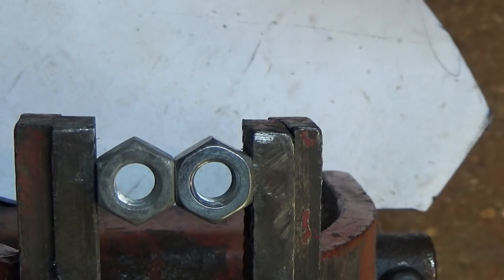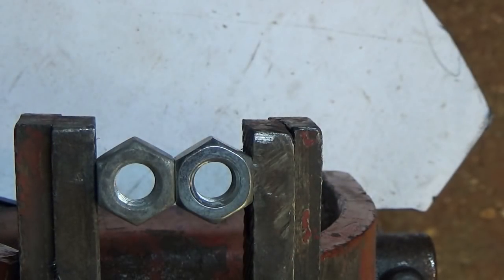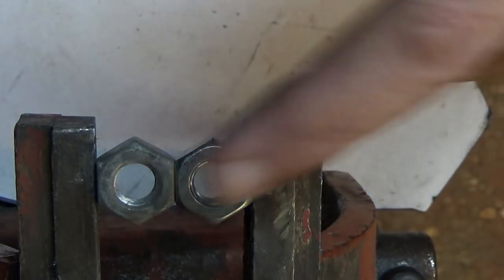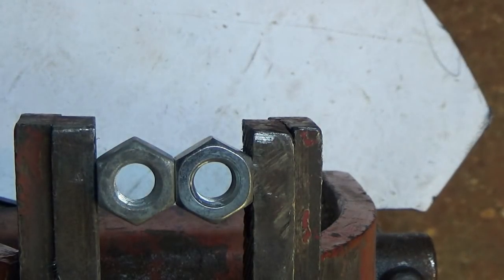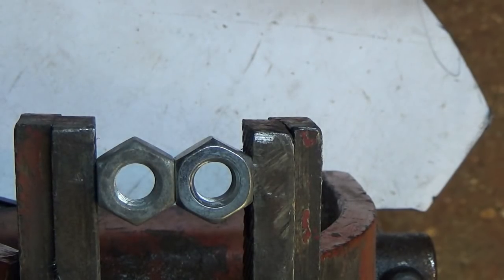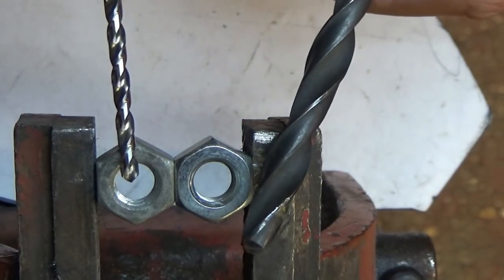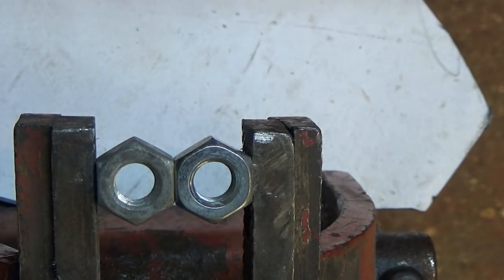You really don't have to spend a lot of money buying various tools to sharpen things - just learn to do it by eye. This is a really handy gauge. I've been doing this 10 years now and I've got a blind spot with this and never sharpen my drill bits accurately, so this is a really handy tool to have around - and dirt cheap, just a couple of those hex nuts stuck in a vise or welded. I hope you find that useful and you can save yourself some good money on your drill bits.